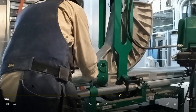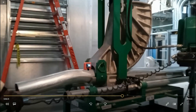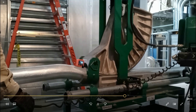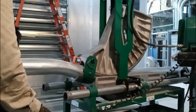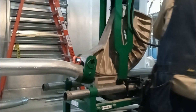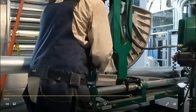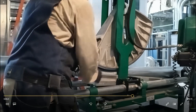Now that it's level, I check my no-dog. If it's not good, release the lever and try it again. After you put your digital level on, you zero it out — that's very important. If you don't zero it out, you'll have to add the difference, just like you would with a protractor. With a protractor you can't zero it out, so if it's two degrees off, instead of taking a 90 to 93 degrees for spring back, you'd take it to 95. You add or subtract based on where the protractor reads.